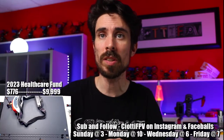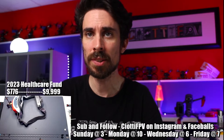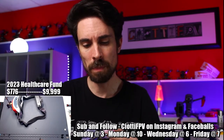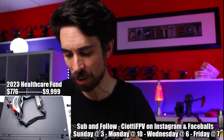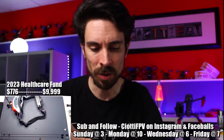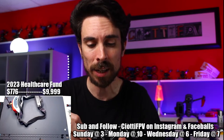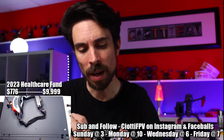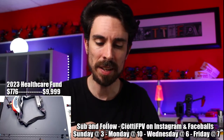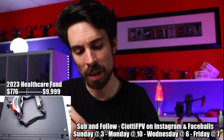Stingray Zay says, solutions to help with better stick resolution for whoops. Sticks rarely leave center when flying. You got to work on your rates, Stingray. Basically, you just need more expo. Expo is typically the answer to what you're getting at here. If you're not already on actual rates, definitely switch over to actual rates. Put your center stick sensitivity pretty low. I use a value of 40. That is extremely low. You might not want to go that low right off the bat, but give it a try.